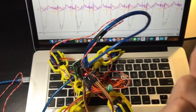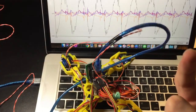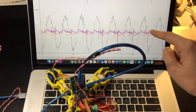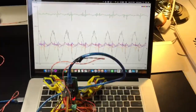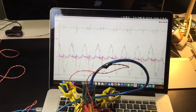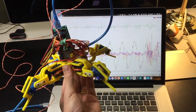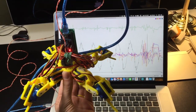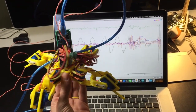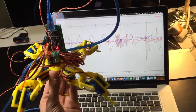But I would hope that gyroscopic motion, rotational motion in the y-axis, if this is the y-axis, is the gray line, because you can see that it's following it fairly well as the robot turns in that direction. If I pick the robot up so that it's not controlling its own movements, you can see that the motion data is completely chaotic unless I hold him fairly still. So if I turn him left and right, let's try a slow left and right. Yeah, that's the gray line there.